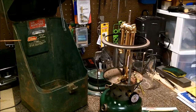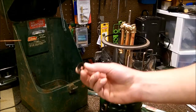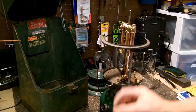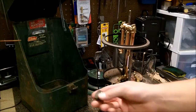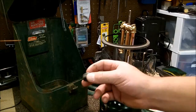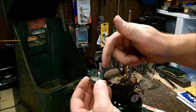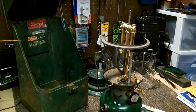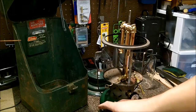Finally got the last two parts I really wanted from oldcolemanparts.com — the leather replacement cups for the pump assembly. I went with leather because I think they work better on these older ones. One part I wanted that isn't currently available through oldcolemanparts.com — I found a few on eBay but they wanted a small fortune — is the cap with the air chuck valve stem on top so you can fill it using a small bicycle pump like this.